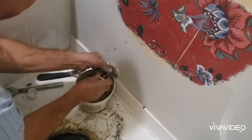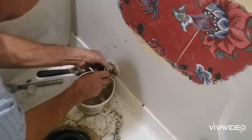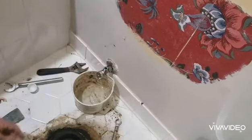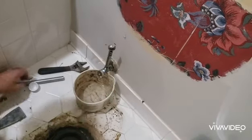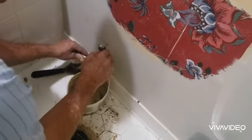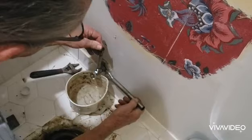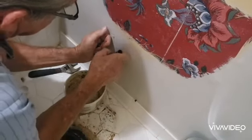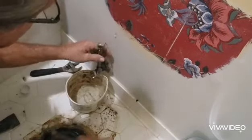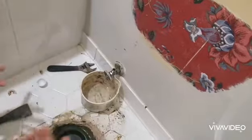We're just going to put the new one back in place — it's literally that simple. Knowing what kind of valve you have is important though. Like I said, it's a compression valve, so we went back with a compression valve, and yes, that needs to be really tight.